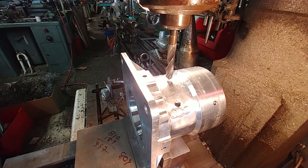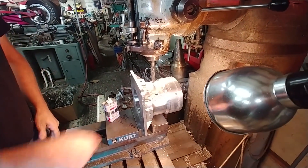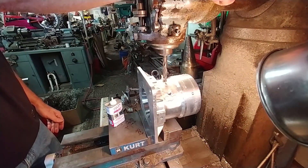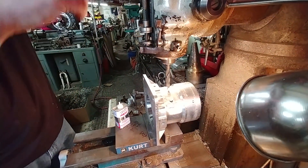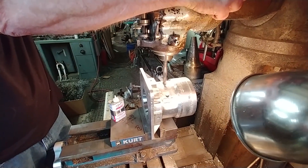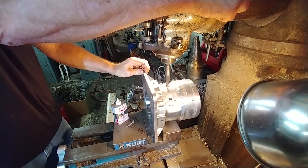We're now on to Friday morning, back at Brit's place for a couple more jobs that still needed to be done. The first one is drilling the drain hole on the angle in the side of that housing. I ended up doing it at about the 54-degree mark up from the bottom, which means there'll be about three-quarters of an inch as the deepest level in the center of that housing where oil will remain, so it'll always have an oil bath on those bearings at startup.